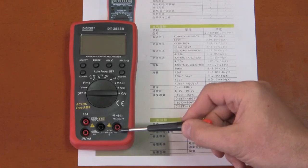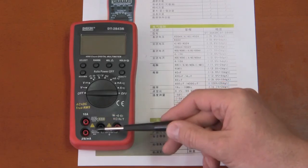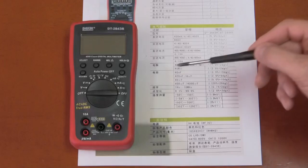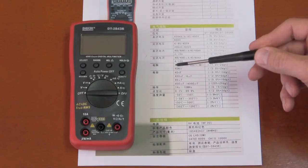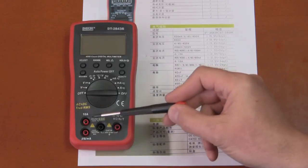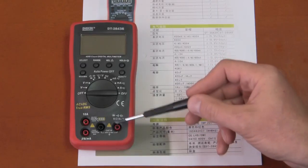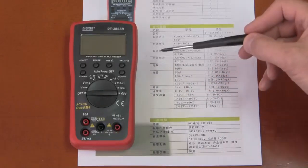At least both jacks are fused. But technically, this does not meet current CAT ratings specifications or requirements — every jack must meet the highest voltage and CAT rating as far as safety goes. We'll have a look inside later and see why it's that way.